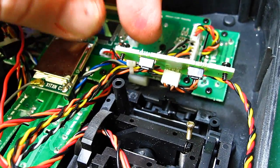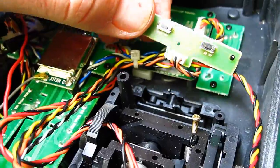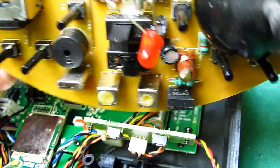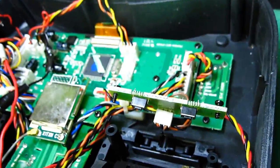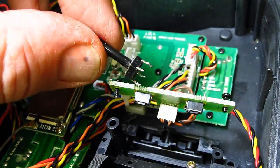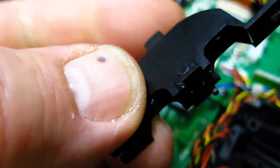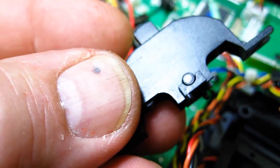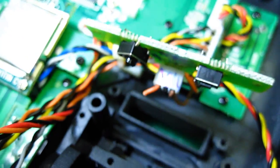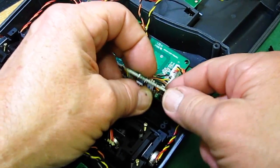My Spectrum DX6i — I know it's old — but this switch right here is not working. This is the trim switch. So what I've done is I've taken apart one of the old Firebird Phantom radios and I stole the switch out of it to replace it here, and hopefully that will work. Early on there were trim problems with this — people were breaking the plastic — but Horizon fixed these and that's not normally the problem anymore. My multimeter said the switch was good, but with intermittents that's not always true, so I changed it out anyway.